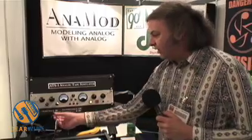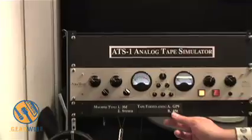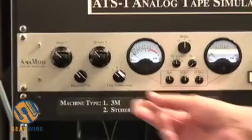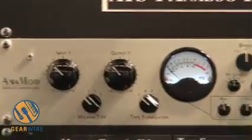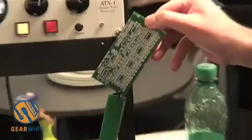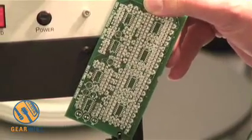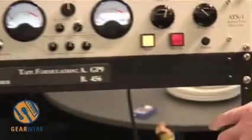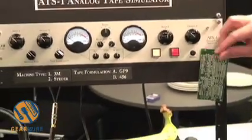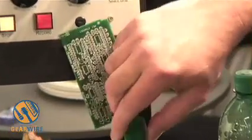There are plug-in cards. Right now you can see there's a 3M and a Studer loaded in. We also have different tape formulations — GP9 and 456. Here's what the cards look like. This is a machine personality card. There's room for two more of these in the machine; it comes loaded with these two. And there's a tape formulation card, which is a smaller card that plugs in as well.